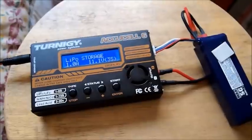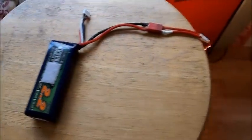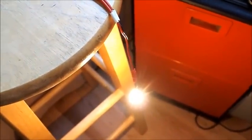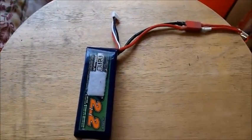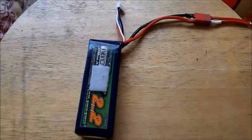After just a little bit the charger gets very very hot. So I've come up with another method to discharge — it's just a battery hooked up to a 12 volt light bulb, with a watt meter on that, which is roughly about 1 amp that it's drawing from the battery.